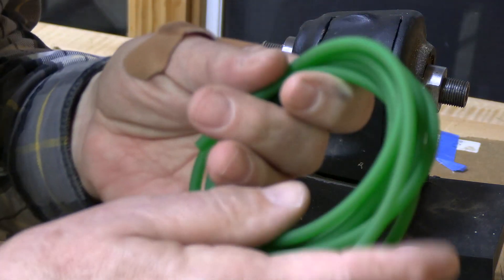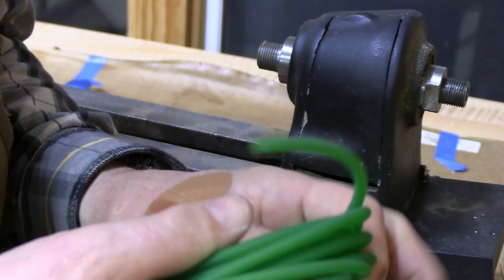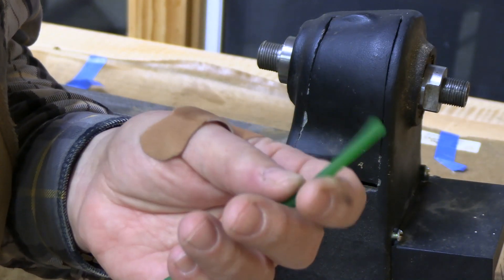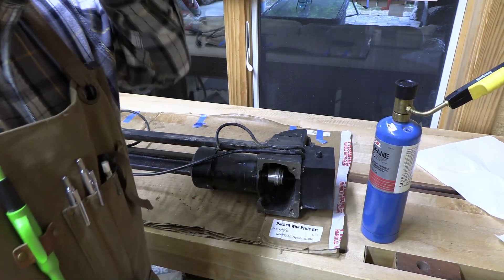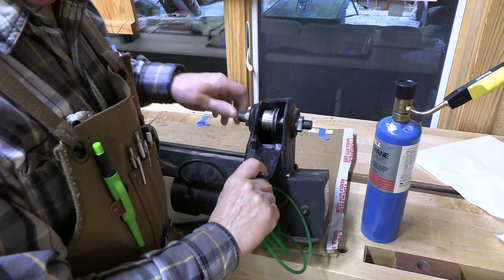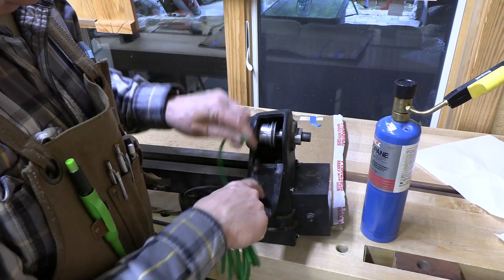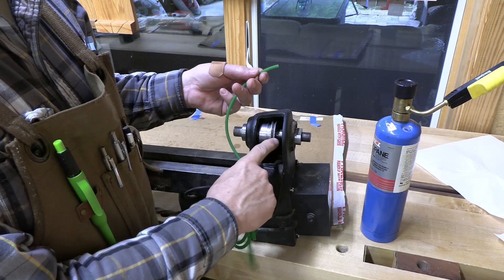I purchased this material — 10 feet of 5 millimeter diameter polyurethane. Supposedly, you cut it to length, heat it under an alcohol lamp, and put the tips together. One of the great things about this belt replacement is I don't have to take this drive spline out — otherwise I'd have to pull these two bearings. As a cord, I can bring it up and over, identify the amount, and seal it together while it's already in place.